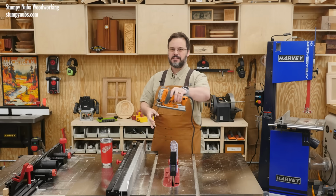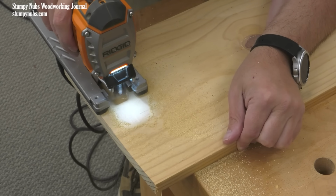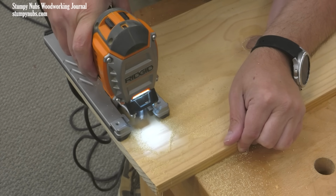This particular saw has a lower profile, so the center of gravity is closer to the material. That makes it a little easier to maneuver. It's nice, but I wouldn't consider it a must-have feature. I do like a saw with a variable speed mechanism, so I can run fast for softwoods, a bit slower for hardwoods, and really slow for metals.